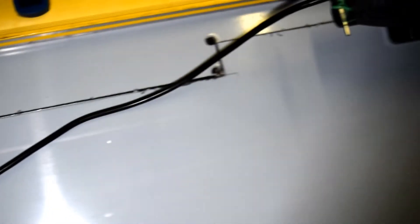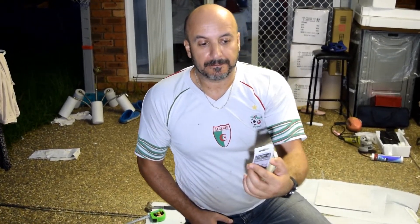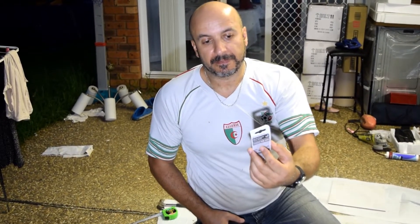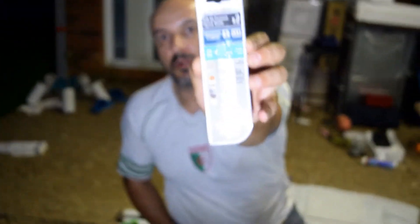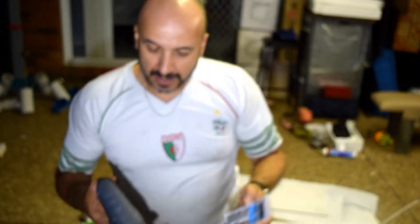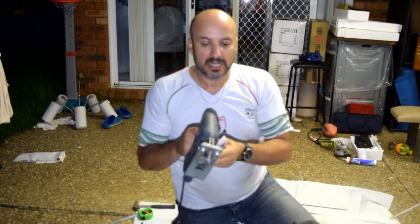I made the first cut, the second cut, and then started the third cut, as you can see, just following it all the way around. The blade has to be either a metal blade or a universal fitment — basically an all-purpose blade. This one here is an all-purpose blade with very small teeth so that it can have straight cuts. Also, with the jigsaw, put it to maximum speed so that you're not going to have any chipping and you're going to have a straight edge.